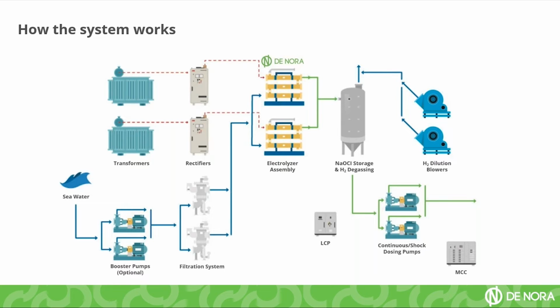With the help of a pH measuring unit and instrument, you will see that the potency of the acid will start to diminish with time, so the pH will start to increase a little bit up until a point where it doesn't increase anymore. By reaching that point, you have already reached a completely full acid cleaning, so you can reconnect your system and start operating again.